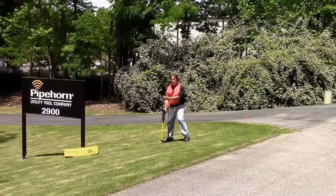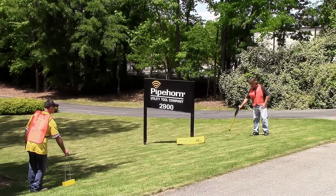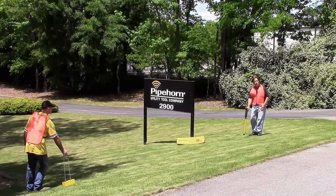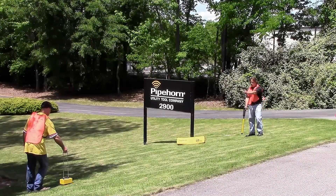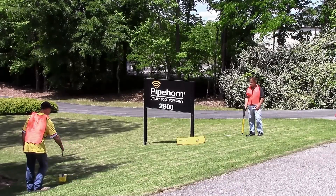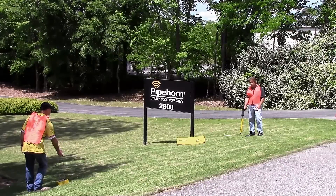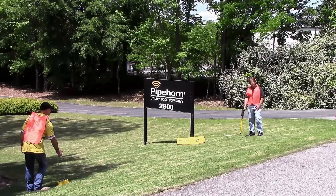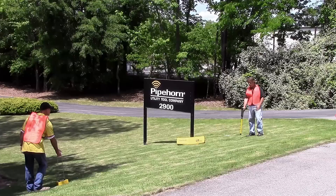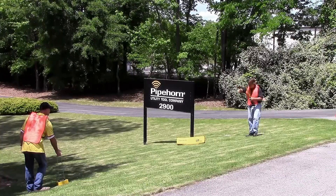We ignore that spike — there's another spike. We put our transmitter on the ground, adjust our sensitivity, and pinpoint with our receiver. Next, we want to align our transmitter. We adjust our sensitivity and pinpoint once more with our receiver, then check our signal source. There's another unmarked line in our work area — we're going to mark it.